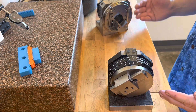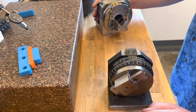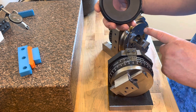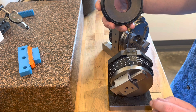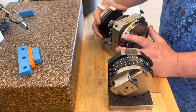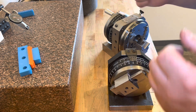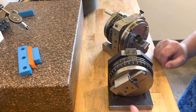If you're familiar with differential tooth indexing, you might have used a product from somebody like AA Gauge or Moore Tool — in my case, Newbold Precision. I like the Newbold differential indexers because the gears are plastic, and that seems like a really poor choice for precision work at first, but consider these are used in a grinding environment. If a speck of grit were to get in there, it's much more likely to embed into the plastic and allow it to comply accurately, whereas on a steel face it would hold up the works. The plastic is also easier to get everything to average out. Technically they're supposed to be a tooth every degree, but let's say one of them is a degree and a couple minutes — it's going to stretch or squeeze, and that error will get averaged out over the total number of teeth.